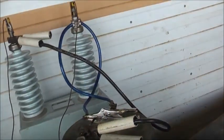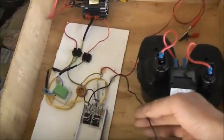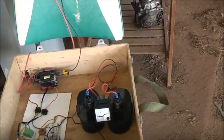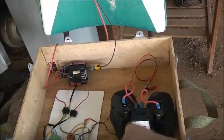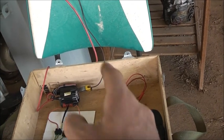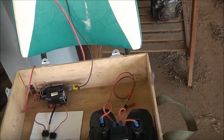I've got to make a proper containment chamber. You've got a bus bar setup, chamber there. Short leads as possible is the best way to go. I've just got to find a way to switch this thing remotely - that's the only Achilles heel of this circuit. If I had long wires the voltage drop would be a problem. A washing machine pressure switch - I've got one out of a dishwasher. It's got one click and another stage, so I'll get a little bottle and a long bit of hose and just squeeze it to turn it on.